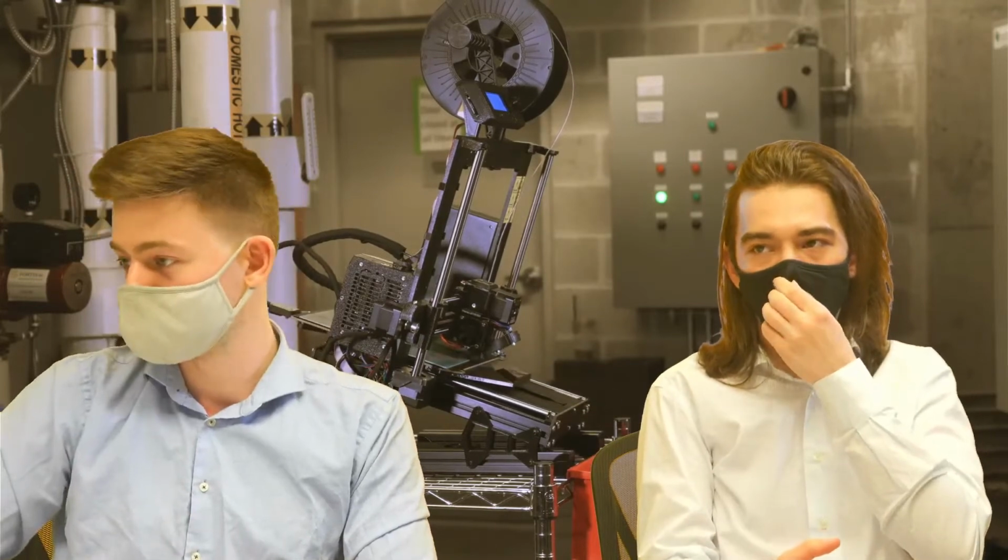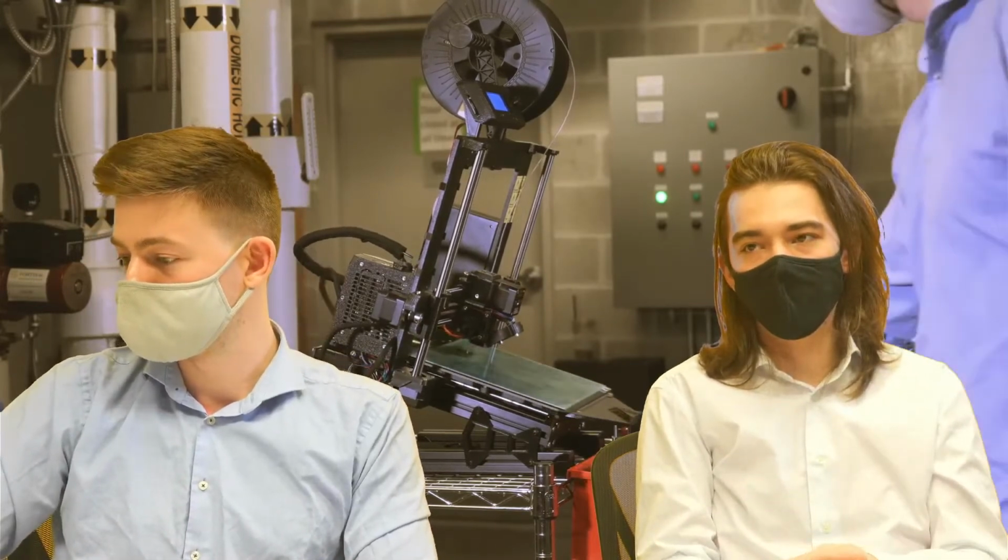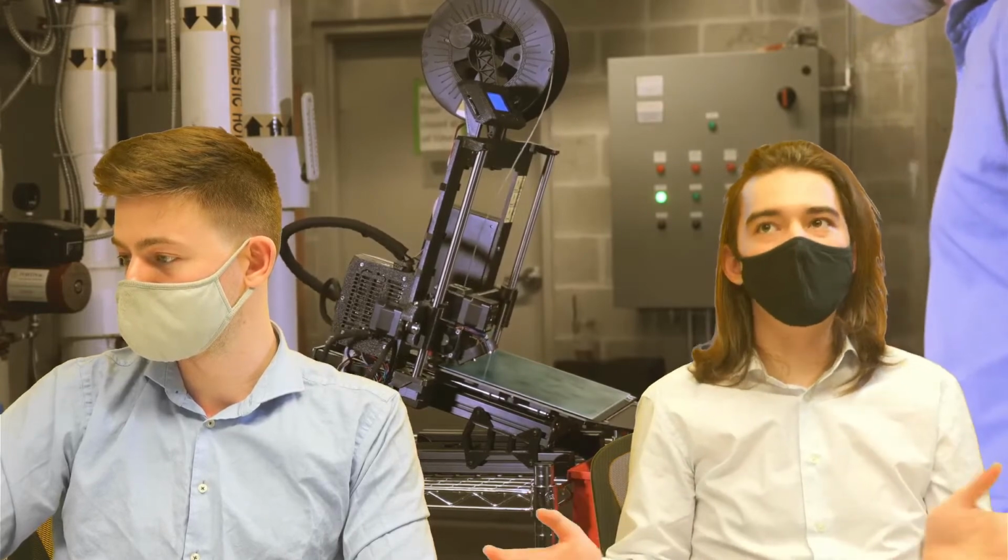So there are limitations in slicing. You can customize, but it's really complicated. You're spending time in prep now. You're pushing a lot of the time into your prep, and now you have to consider, okay, how do I make the parts add up to 24 hours? Or, if you're getting 23 hours, you're still losing an hour a day of printing.